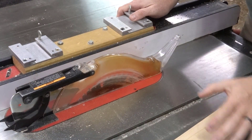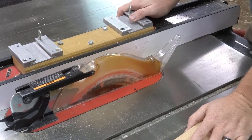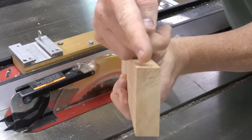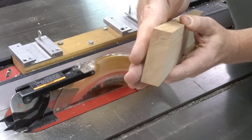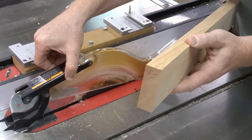At this point I've zoomed in quite a bit on the saw blade because we're going to be doing a bigger cut that I need you to see. To make this cut, it's going to be down the long edge with the board sitting this way against the fence. We're going to be cutting a thin strip off the entire face, which means we have to raise the blade quite a bit and we have to take the guard off.